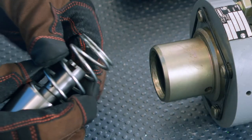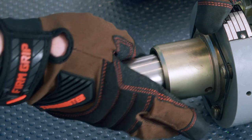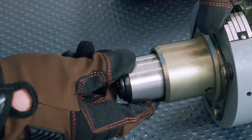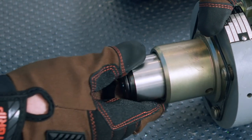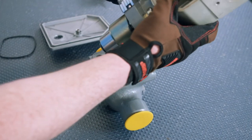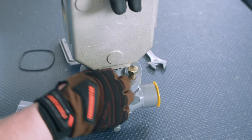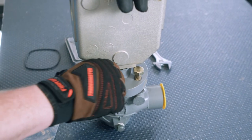Be careful not to nick or pinch the o-ring when tightening the equalizer bypass. Set the mainspring in place on the valve plug. Attach the stem to the coupling head of the valve plug through the bonnet. Place the bonnet assembly onto the body using a new o-ring and a new external o-ring, and secure the bonnet by tightening down the nuts or cap screws.